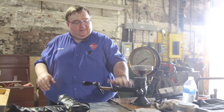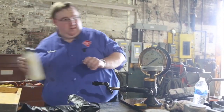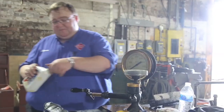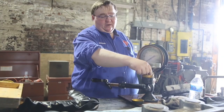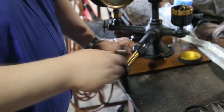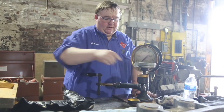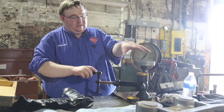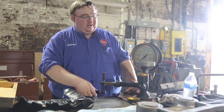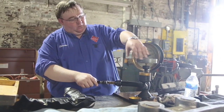It's actually fairly simple. This cylinder acts like compression — you put mineral oil in, which is what's recommended. You fill this reservoir right here with a little bit of oil, and this oil is then used to compress and test the gauge, just like a drip cup in a steam locomotive. You back the screw all the way out, which causes the oil to get sucked into the system. You then turn it closed, and when you start putting the screw back in, this weight will actually start to bounce as I start pushing it in. We have about 150 pounds of weight on here.